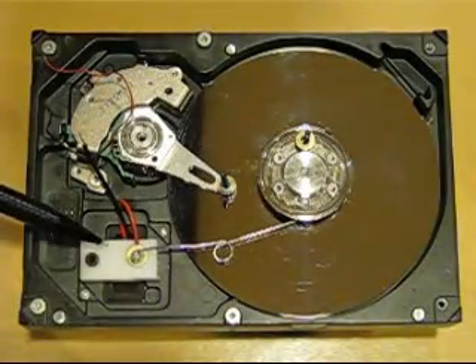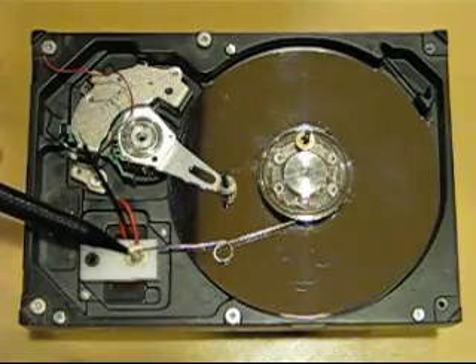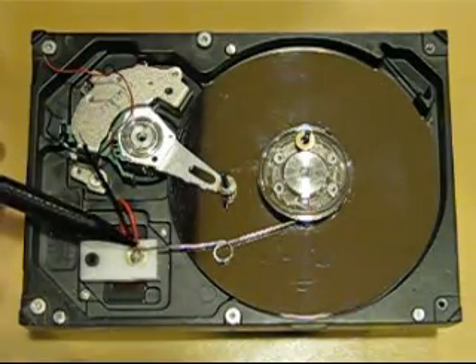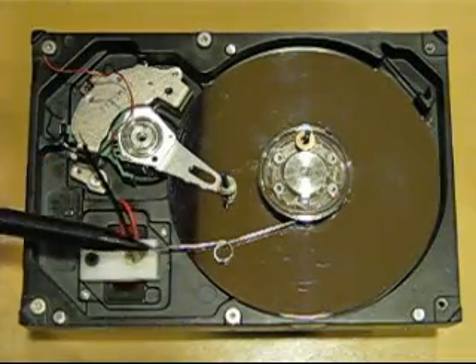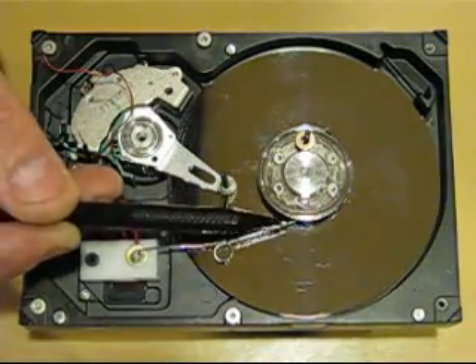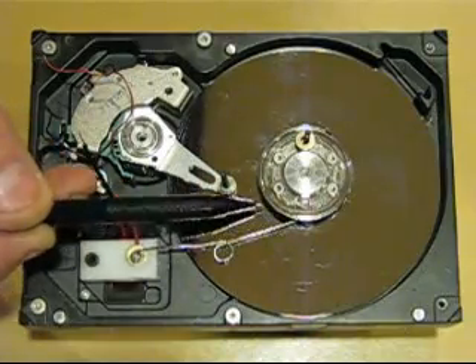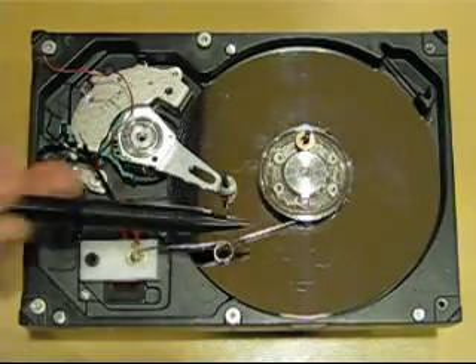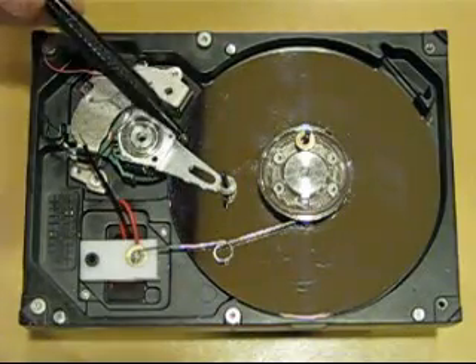Here's my hard drive. What I've done is taken a Delrin block to give me a plastic block and insulate my timing mechanism, which is just a safety pin that I've stretched out. It rides against this hub and is timed by a piece of Teflon tape around half of the hub, so that it can't touch the pin except when I want to engage the solenoid.